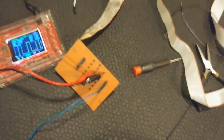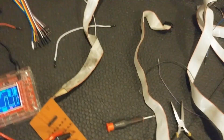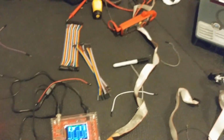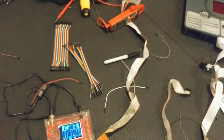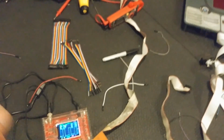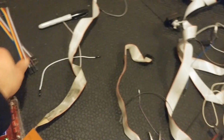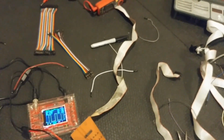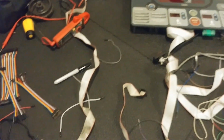One thing you can do is just get the thing powered back on again and read from each set of pins what the voltage is at each spot. I know from there, we've got a couple pins that sit at 12 volts when the whole thing is idle, and a couple that sit at 5. So there are two different voltages commonly used on electronics like this. Basically, if you hook up one of these wires for the ground, and test one by one each of the other ones, eventually you'll find one that gets some life out of the board. And that one is your VIN.